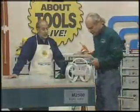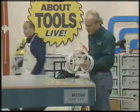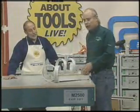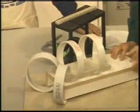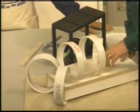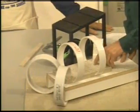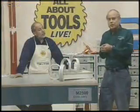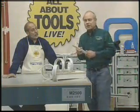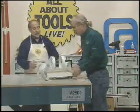So this is basically how you can do it. You can make up your own boxes. I have several fabricators that do that as long as it's flat and level. Some fabricators say, well, it takes longer, but it really doesn't because you have so much to do in solid surface work. The setup time and the time you save in routering and sanding, you can actually save about 35% on a kitchen in fabrication time by switching to this method. The other thing is you don't have to worry about your particulate going through the material like you normally do on a stack layered edge. And some fabricators will do one edge and another edge on top, which is very time consuming. All right.